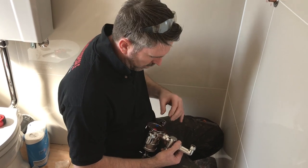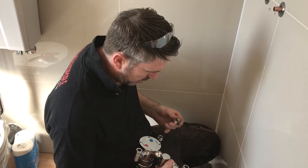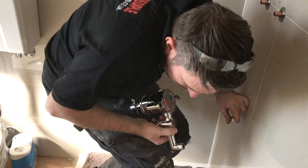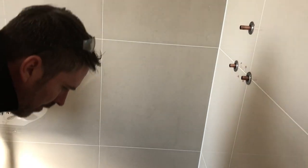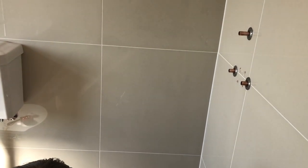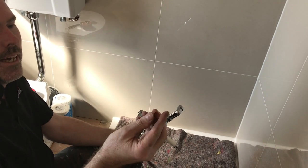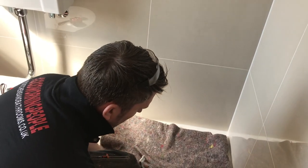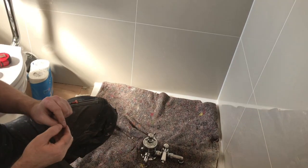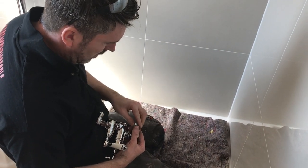Now you could put these on. Now this one, where's my olive? Here's my olive. See how that one escaped? See how that one's knackered? Don't try putting that back on. It's not worth it. Squash it. Throw it. Go get another olive. Nice brass olive.